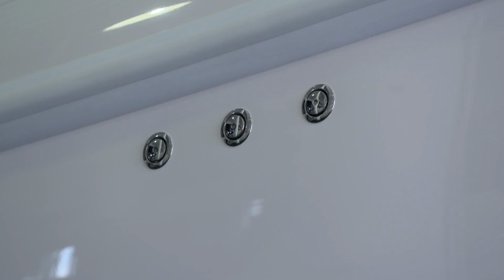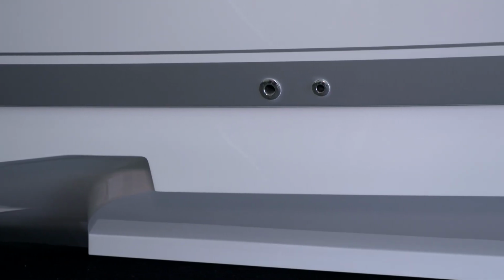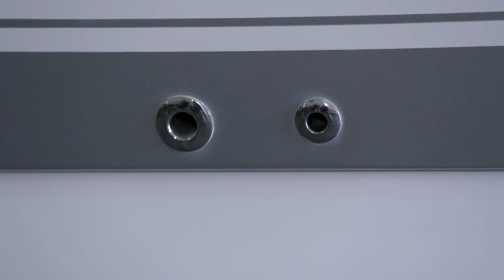On the starboard side of the boat, just below the rub rail amidships, we have 3 vents. These vents are for the diesel tank and the waste system. On the boot stripe, just forward of the step on the starboard side, we have a discharge for the shower sump system and a relief for the air conditioning. Moving forward on the starboard side, we have the drain for the sink in the head compartment. This stainless steel fitting is installed in the boot stripe.